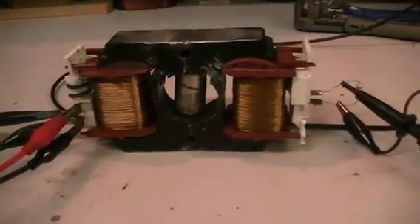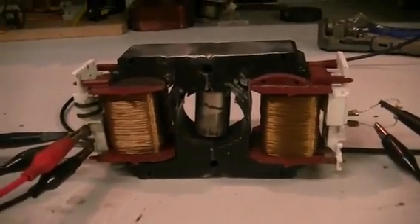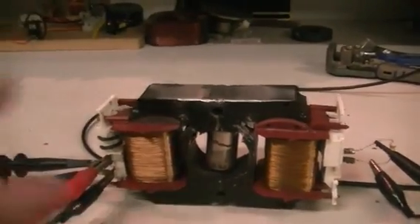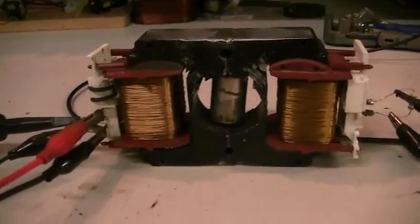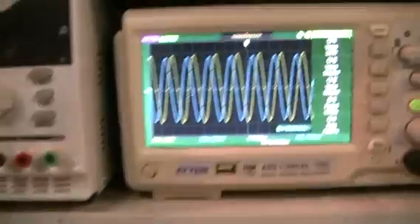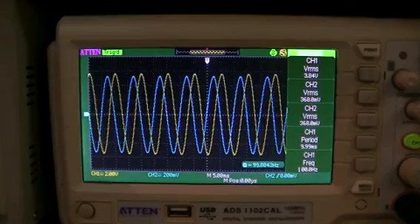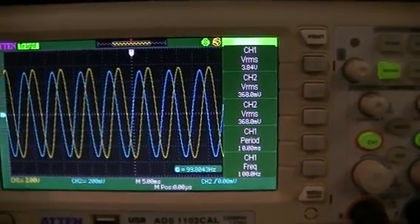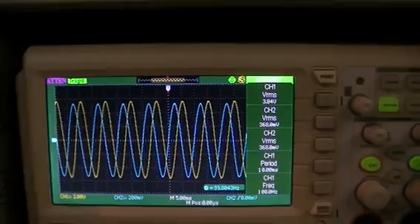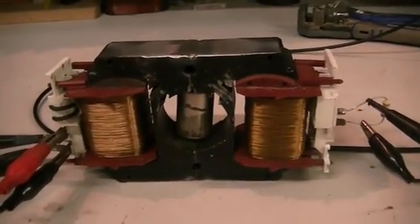Very interesting effect. We have no bias by placing that magnet in there, even though the field is not alternating, and it is an extremely strong magnet — an N52, 3 quarter inch by 1 inch. We get no biasing of the current output on our secondary that we would expect to see, and rather than killing the output it has actually amplified it by 6 times. That's quite interesting. I thought I would just share that before I go ahead and turn this thing into a generator.